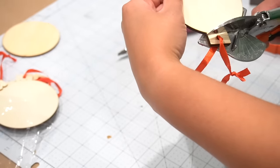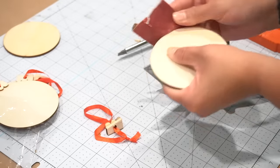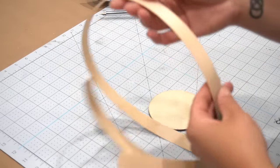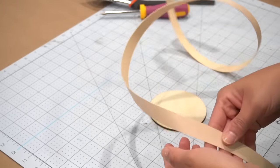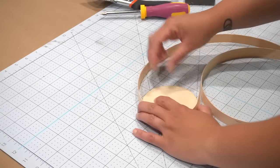I figured it was a perfect time to use them for something. The first thing I did was remove the little top pieces with my miter shears and then sand the area to make sure it was nice and smooth. Then the little round disc needed a little lip, as you see in this picture. So I used this stuff called Edge Mate — basically what you put at the edge of plywood to give it a nice clean look, like on cabinets. I wrapped it around the disc to get the exact measurement needed to go all the way around.